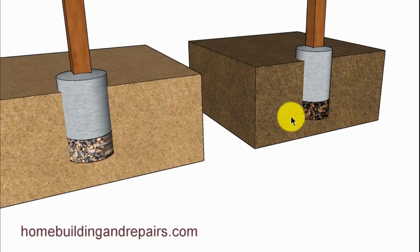In the clay soil, we're back to the problem where the water could accumulate under the gravel and create problems, for the concrete will absorb water. If you have a pool of water in the gravel and the concrete's on top and it's constantly absorbing the moisture out of the gravel, what's the difference? Get rid of the gravel and just let it absorb the moisture out of the clay. Don't create a pool that this thing can sit in.